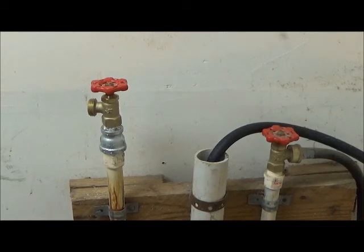Yep. The cold water side is now fine now that I've replaced it, but the hot water side is leaking. Now you will notice on the hot water side that there's not as much hardware on it. There is just the valve and a reducer, a much simpler installation than the 3-piece unit I used, plus less subject to corrosion because you just have the PVC and brass.